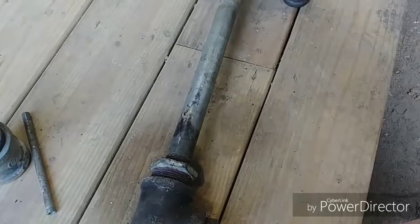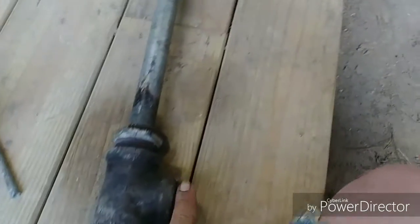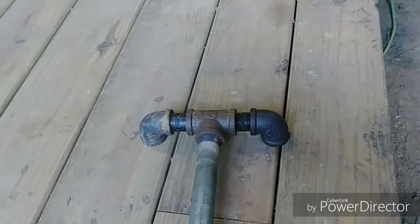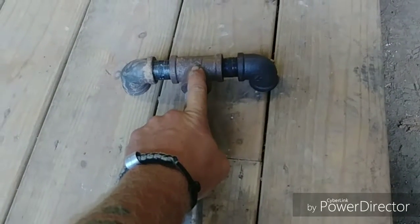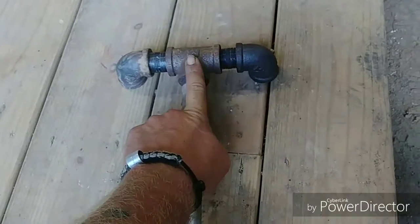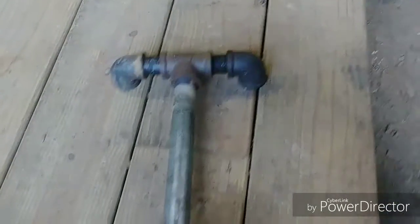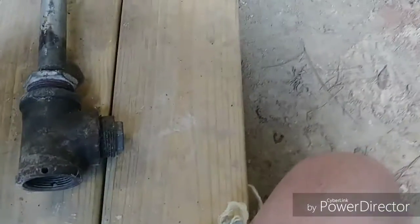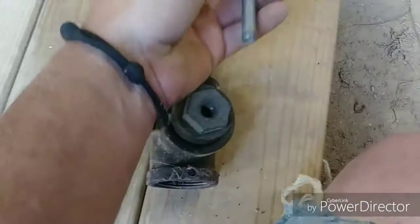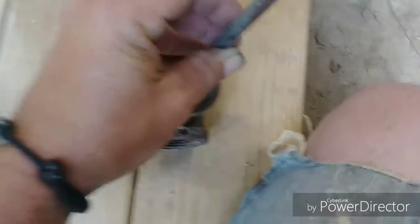We have a three-quarter T with two close nipples and two 90s. The air and fuel will start mixing right here, come up through here, through the impeller, twist around, and trip all over itself. It'll get up here and hit a dead end where it has to go left or right, creating an eddy current in either direction. Then it's got to turn again, creating another eddy current on both sides — so there ought to be plenty of mixing. As far as the gas being introduced, that three-eighths bushing I told you about — this three-eighths brass tube fits right in there.